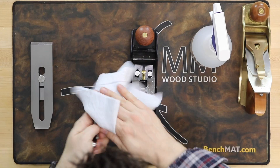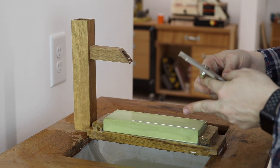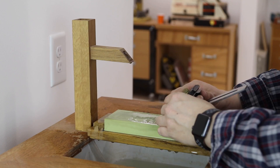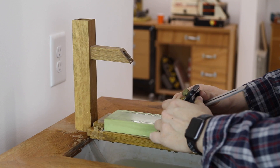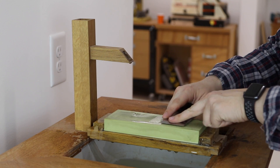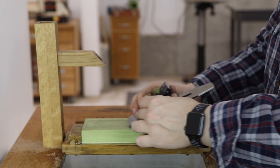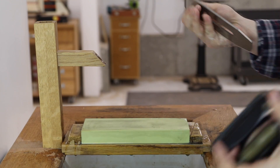Let's take it apart, get it cleaned up, and get the blade sharpened. With my honing jig set at 25 degrees, I lock down my blade and then change the rollers to bring it to a 2 degree micro bevel. My next step is to just slightly chamfer the blade by applying pressure on either side with equal strokes. I did the same thing with the Lie-Nielsen blade — 25 degrees in the honing jig, a secondary bevel of roughly 2 degrees, made my passes, sharpened it, and gave it a little chamfer.